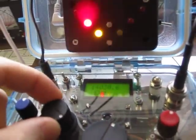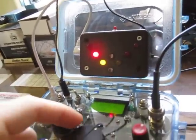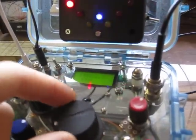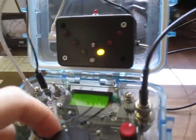The RF gain is good. Turn it up all the way and this receiver is pretty hot on these SW rigs. I just sold a 40 meter version that had a 10-turn pot for tuning. This one is just the standard, which is fine — I have this one calibrated to cover the whole 20 meter band.